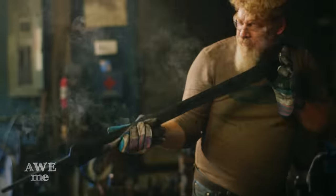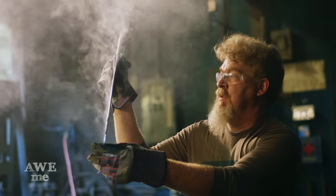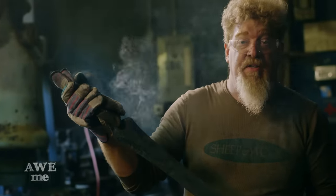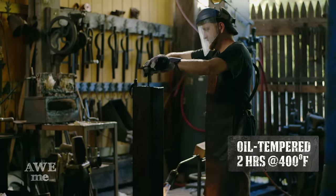It's a really critical phase that you have to play around with the straightness, and the blade's around 600 degrees. So now we'll be ready for the hot oil bath temper. Even though it's still fairly hot, it's moved out of what we call the super plastic stage, which is when we can straighten it. It'll become very hard and almost glassy, so we're going to have to temper it so that we don't break it. It's very important.